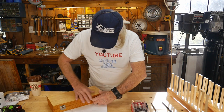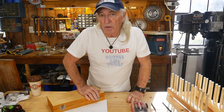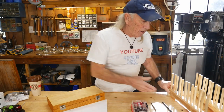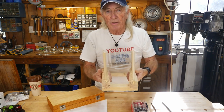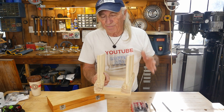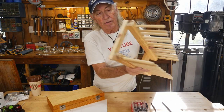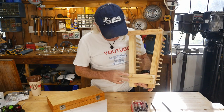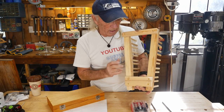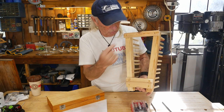There were a lot of holes to drill. I used a centering device I made on the 3D printer — you can also just run a line down the center of the inch-and-a-half piece. I tapered mine at 45-degree angles just to fancy it up, which also helps the lid sit down a bit more. The scrap pieces of lumber underneath have two bits here and here to keep the angle and prevent the loads from spreading — it locks everything into place — then inch-and-a-half wood screws at the top.